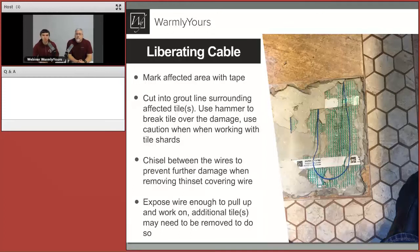There are some tips for this step. If the spot isn't clear, you can double-test by stopping, keeping the tape indicator on the tile, waiting for the spot to cool down, then zapping or using the Variac again. If the same spot appears, you know 100% that's the area. After pulling up the tile, you can use the Variac or high-pot again to get an even clearer picture, because now you're only transferring heat through a thin layer of thinset — your thermal image will be much clearer and you can nail exactly where the spot is.